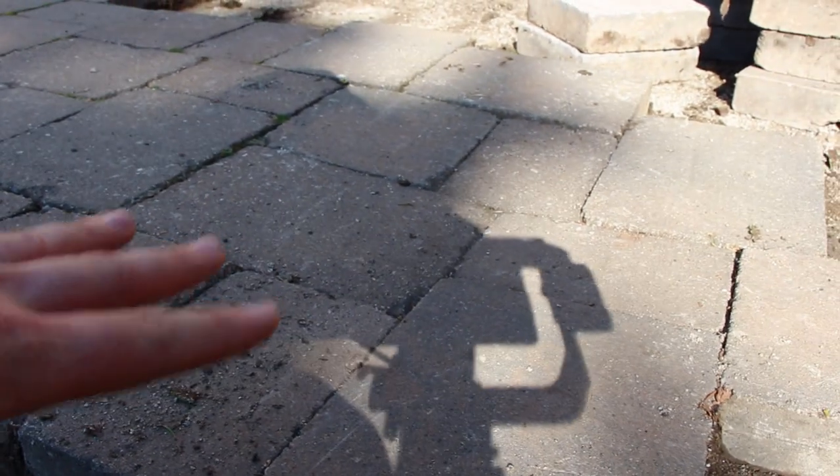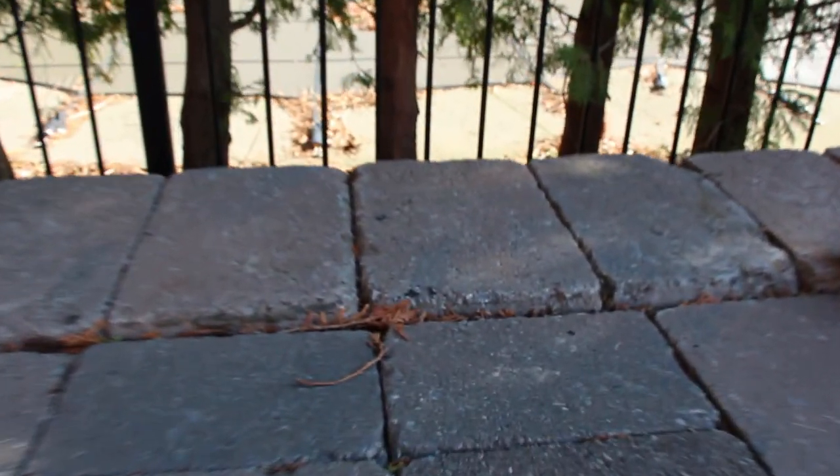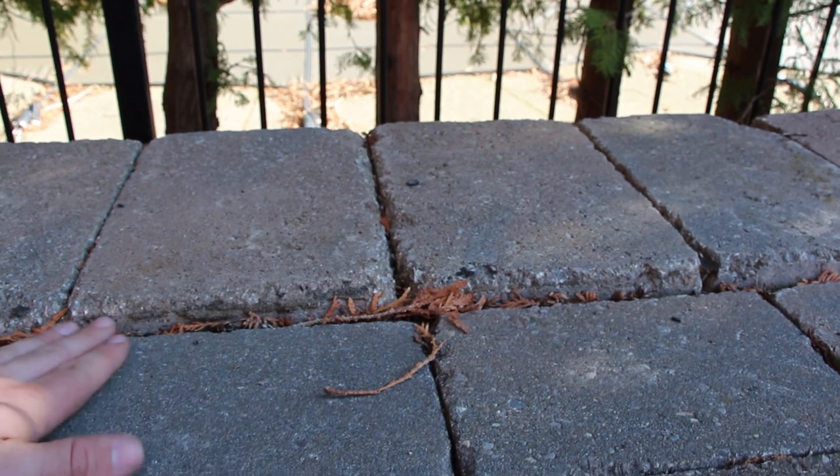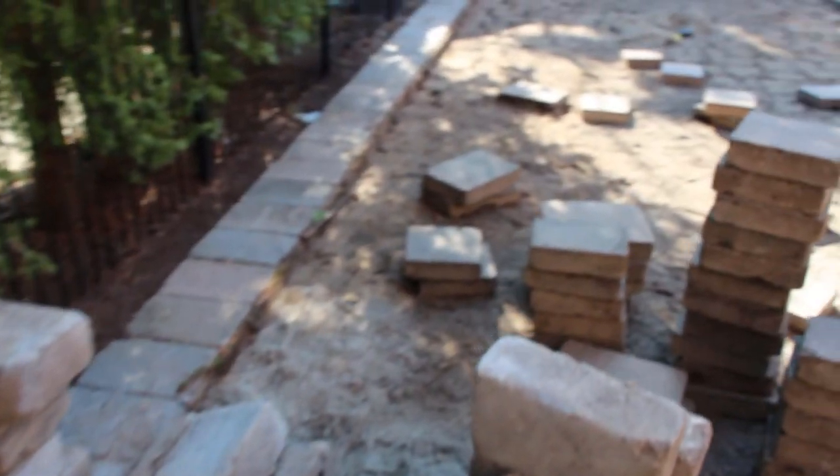As you can see here, it's going to retain your water, and it's going to cause a lot of heaving in the frost cycle. So this is dipped down completely. These steps are pushed out. The top part of this patio is all dipped everywhere, and you can even see along the patio wall, you got a big lip here. You can even see where the polymeric sand was before and how much this has gone down, almost half an inch there and everywhere through this patio. So this is all torn up,